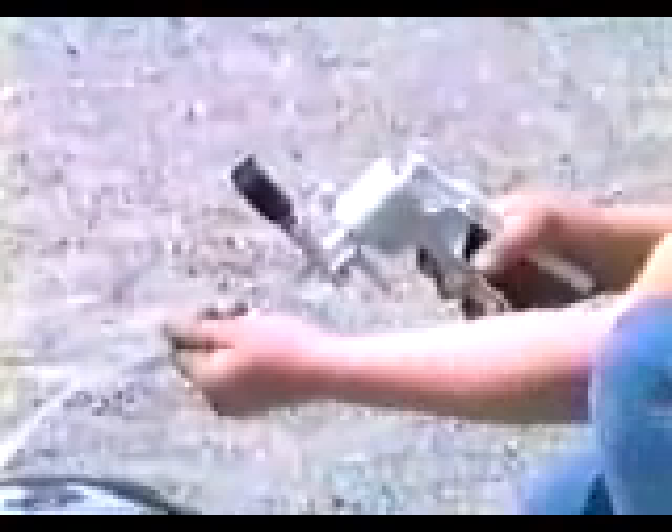Now attach the hand-operated vacuum pump included in the kit and evacuate ambient air in the Teflon tubing. Your vapor sample can now be taken with the equipment of your choice. When analysis is complete, you can remove the retractor tip with the assistance of the removal jack.